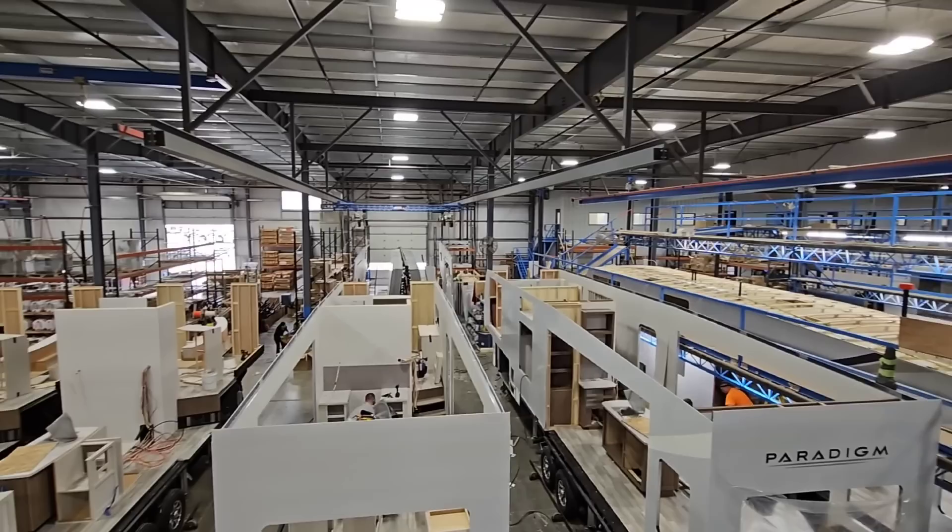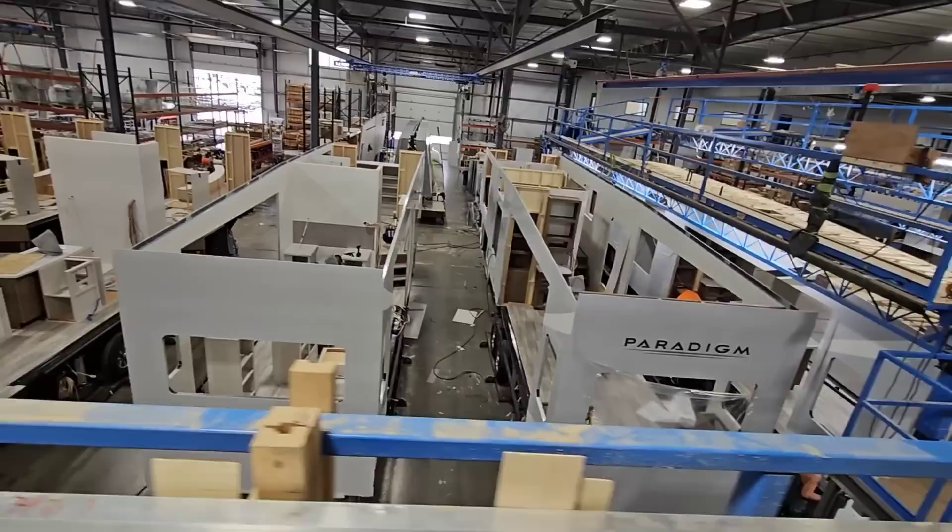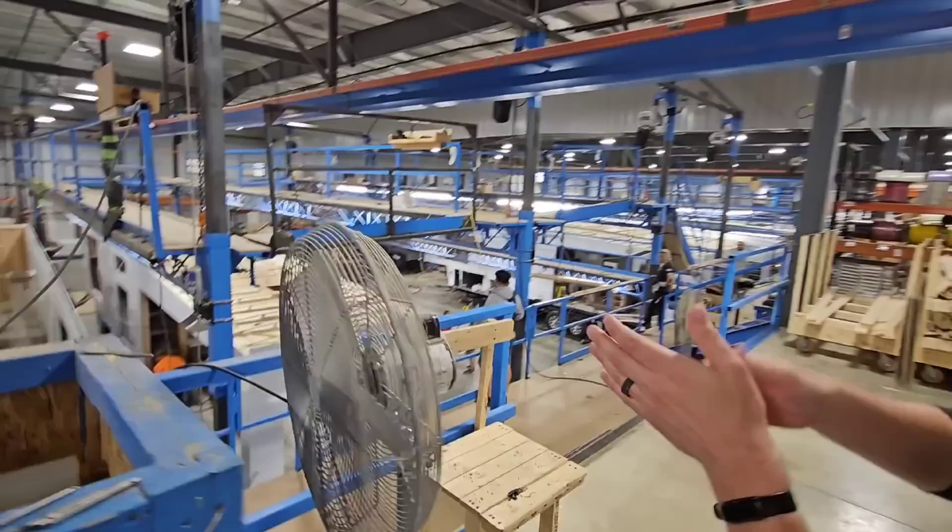Here's the middle of the plant. You can actually see the sidewalls over there — they came from the lamination plant, which JD did a video on earlier. They get put on right here using the blue harness system. Then they do what's called a line roll — they roll the units into a new stage and slowly start adding graphics at this stage.